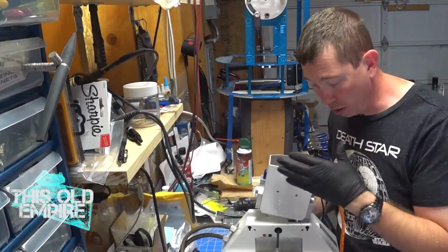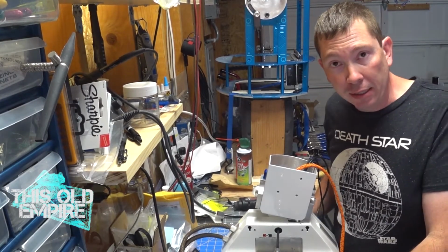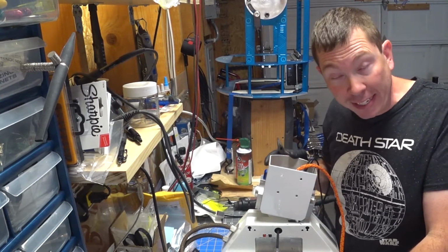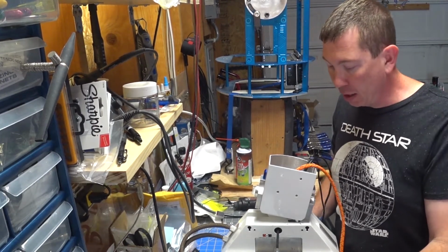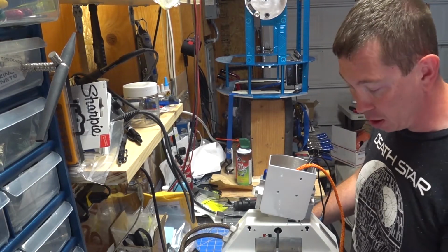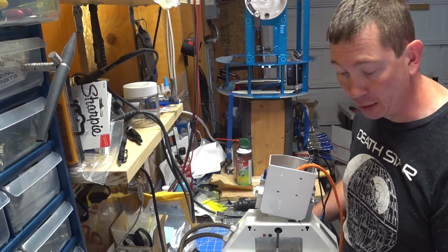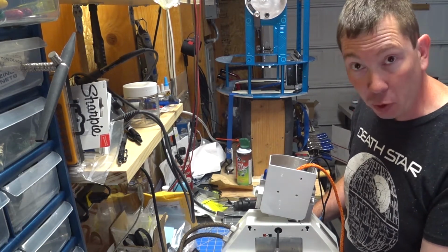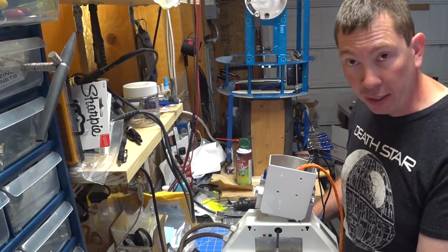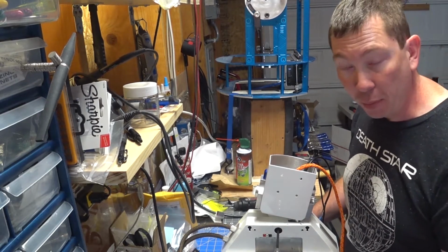As you can see, we're already disassembling the right leg and right ankle and foot and battery box. So as you can see, I have a compartment that will hold my batteries, and I've got some relays and power junctions, a fuse, as well as a cell logger that can manage between the two LiPo batteries that will go in there.